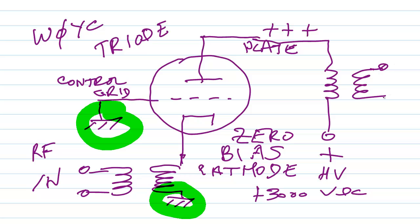You get your RF output here, and you'll probably have some kind of a tuned circuit here with a variable capacitor, which you tune until the plate current takes a nosedive — it dips, indicating resonance and maximum output. Remember that, where you used to have a tuning control, and sometimes also a loading control, and you would have to dip the plate current? Well, that's how these things work, and this is the basic concept behind a grounded grid radiofrequency power amplifier.